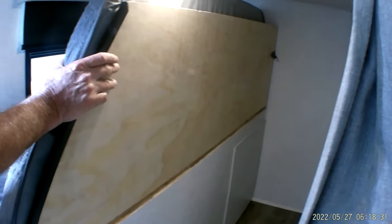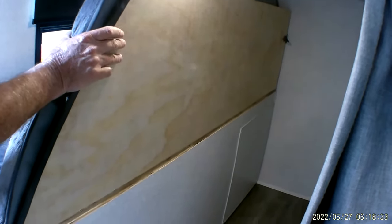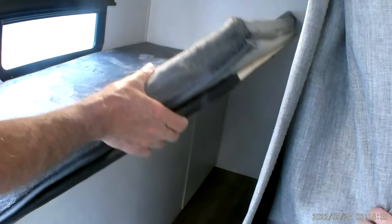On the hot water heater, there are two white valves. Both white valves are pointed towards the tank. That is the normal operating position. You will switch them just the opposite way when you get ready to winterize the unit. It doesn't have fire escape windows top or bottom because it is right by the front door.